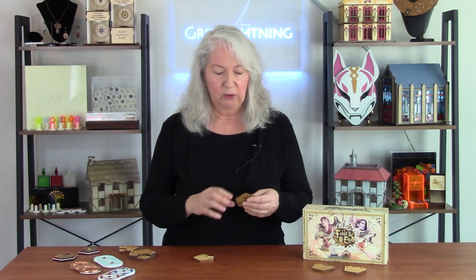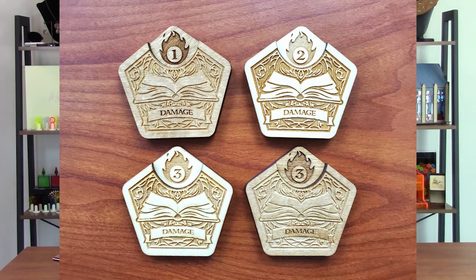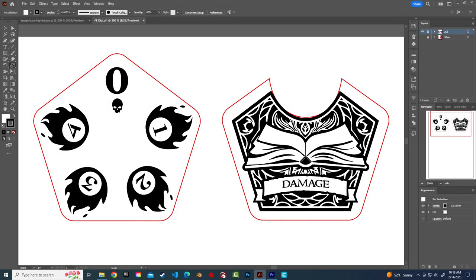Using Steven's artwork, I did Adobe Illustrator drawings and figured out how to get the magnets inserted. I started out with bigger prototypes, but there's a spot they needed to fit into in the box, and that's what these eventually got downsized to. I think they turned out great, and I'm going to talk about how I did the Illustrator drawings and how I cut them on the laser cutter. The original artwork Steven sent me were PNG images done in Photoshop, and to drive a laser cutter I need vector graphics, so I recreated them in Illustrator.